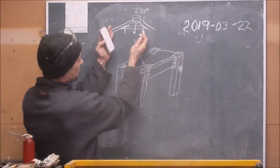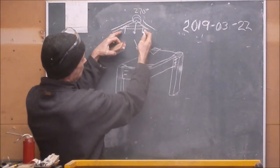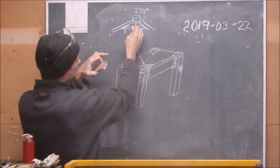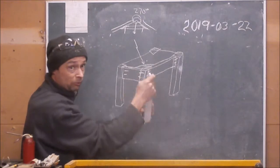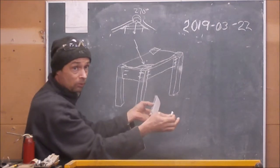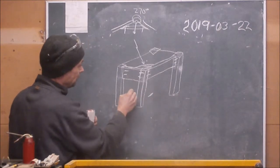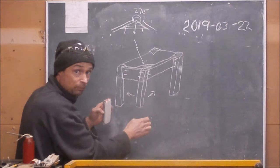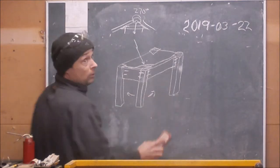So when everything's tight together, when I put screws here and tighten down on the center screw here, it's going to pull the post into the two sides, and there's two dowels as well, and it will prevent it from twisting through certain loads or weight or whatever's on the table, and you won't be able to wiggle the legs from side to side like this, because the pins will be holding everything intact, giving it more strength and rigidity. So basically, that's the plan. So let's get started.